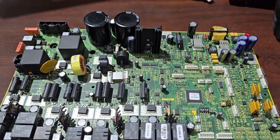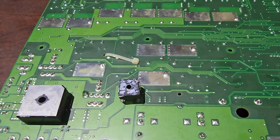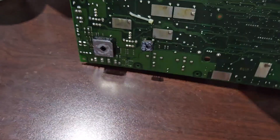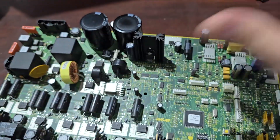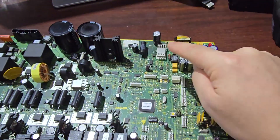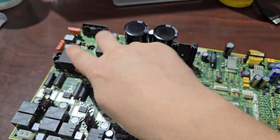What I believe is going on with this board is better indicated on the back — I've got two components hidden on the bottom: a large full wave bridge rectifier and a small full wave bridge rectifier. So this board has two different power phases going on. Most of the power is going to be for driving the motors, but we also have a standby power system which creates a small voltage that goes out to several controls — the bed rails, etc. When you turn the bed on, it's going to turn on the rest of the power supply.